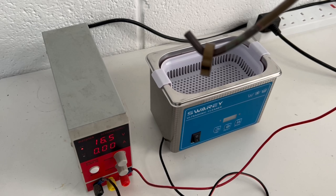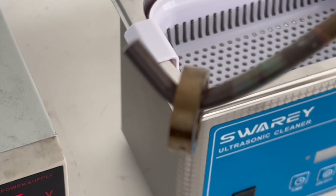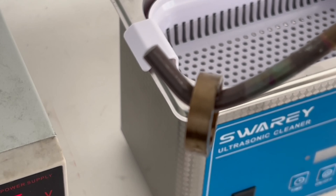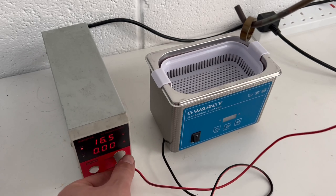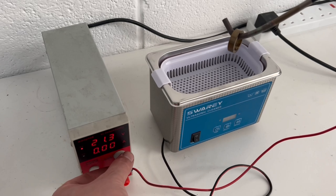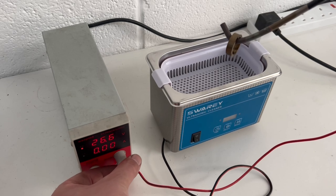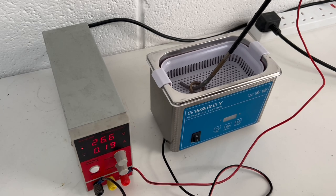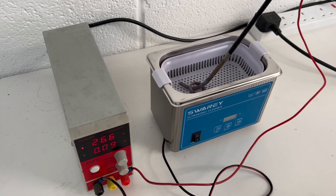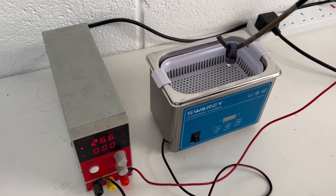So that's changed to bronze — I don't know if you guys can see that. We've got a bronze color on that now. So let's increase the voltage to around 20-something; I think 26 volts should take us to blue. Let's try that. As you can see, it is changing color.